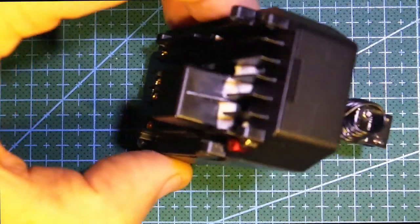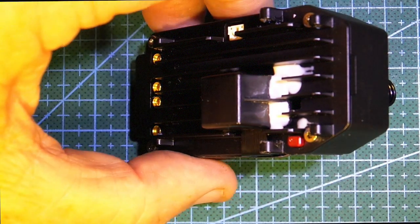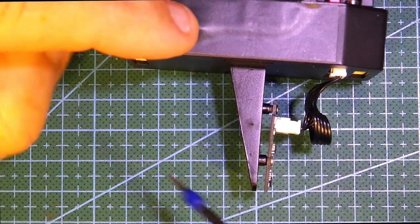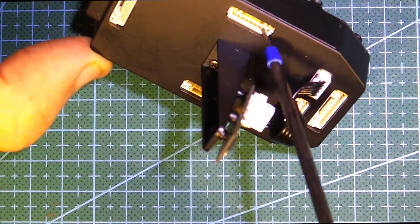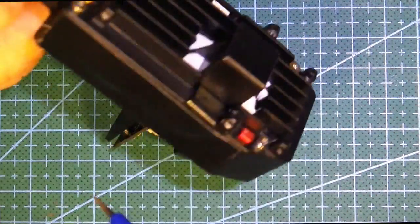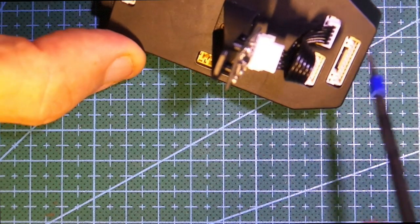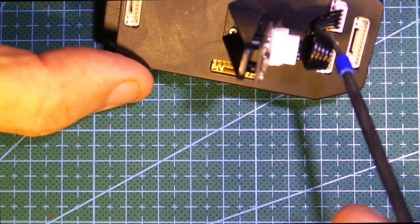The other thing we did was put in a new main flight controller. These are as expensive as all hell — you'll see them for sale on eBay for $700, which is just plain bloody stupid, and I'll explain why later. This is the IMU for the gimbal, these are your gimbal pins, and these two are your main motor controls that go back to controlling your ESCs. Up here is GPS and some other peripherals, and one of these cables goes back to that main battery board.